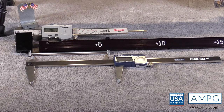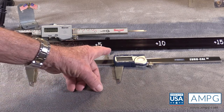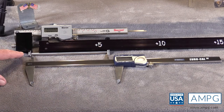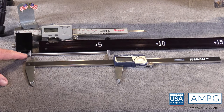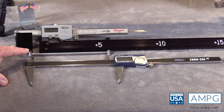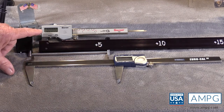I have reassembled the caliper extender kit and added the clamp for the outside jaw. I have put the pin at the 5 inch mark, inserted the calibration standard, and put the second pin into the outside jaw, which is the hole in the clamp closest to the caliper. There are two holes in the clamp — one closer and one farther from the caliper.